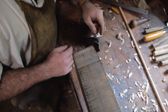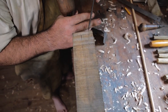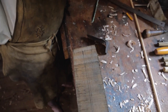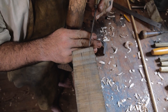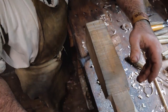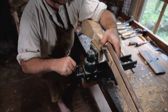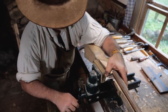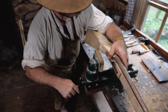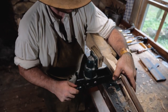All right, so now I'm going to come in with a chisel and my mallet here, and I'm just going to start scoring it just a little bit. You don't want to go too deep here. Flat side goes out. Let me scoot that forward just a little bit because it's bouncing a lot. If you catch it bouncing, then you can just clamp it right here on the wrist, or even on the butt itself, just to get rid of all that unnecessary play.